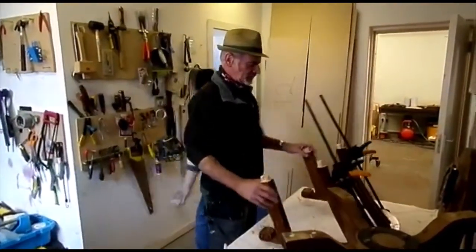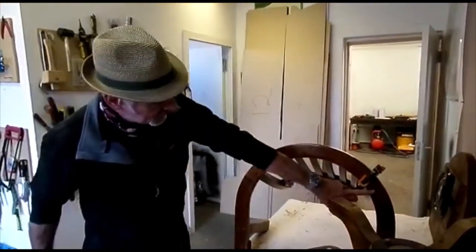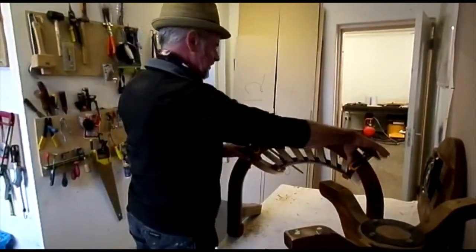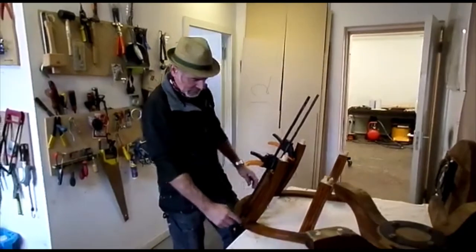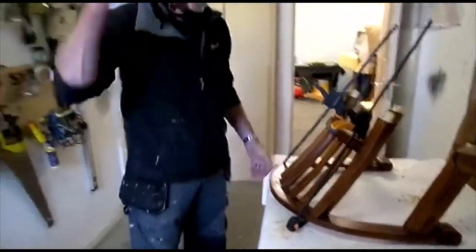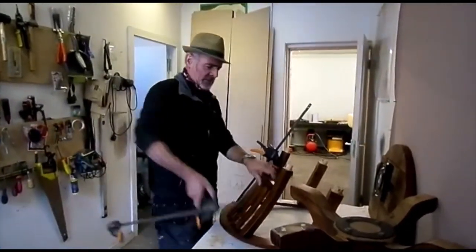The chair we've been working on is loosely based on a captain's chair and was pretty much decimated — cracked here, cracked there, all of these limbs were loose, all of these spars. We glued these areas back together first and clamped them, left them overnight. We then done the next stage, getting these back into position. These spars here, we also used some nails from the nail gun in addition to the adhesive.